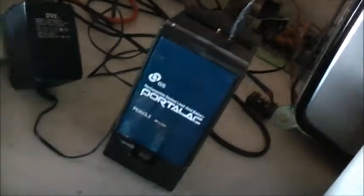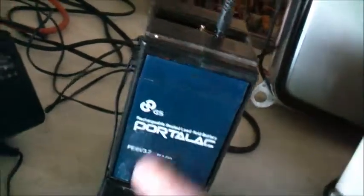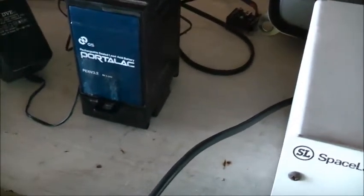Here we are - charging up quite well. Good quality, Japanese quality. I thought these batteries were completely gone. Just put some water in and see what happens - this is just an experiment to see what would happen if I put water in them. Sure enough, they actually got going. They're actually working. As long as the cells look mostly intact with a careful look with a light - they had a lot of sulfation on there, that's why they're all swollen. They're really badly sulfated, but a desulfater should take care of that problem. Amazingly, the plates are mostly intact. There's no lead floating around in there, it's just all dried out - that's one of the reasons why they died. Can't believe it - it's actually revived these batteries. Anyway, that's my little update for now. Thanks for watching.